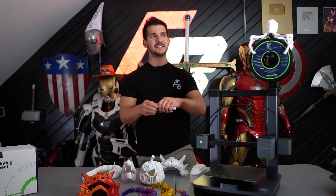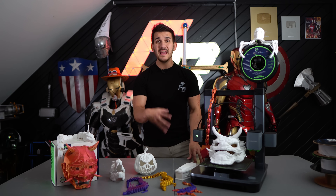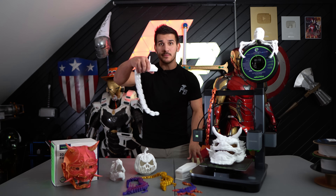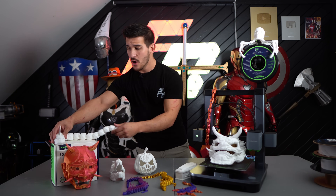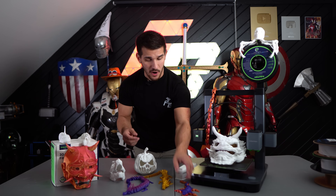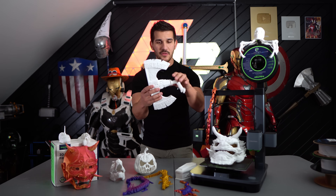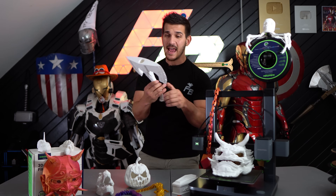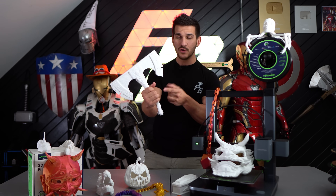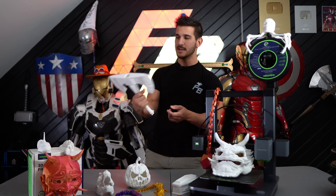The Z offset and distance preloaded into the program and into the app models is wonderful. Being able to handle print-in-place objects is a very good test for the tolerances and accuracy of a printer. All of the print-in-place stuff I've done thus far has printed beautifully. Even that ax that had a weird failure earlier — it was printing great. The accuracy was coming out really nice and the model itself came out really cool too — a little swing-out ax. That's pretty cool.